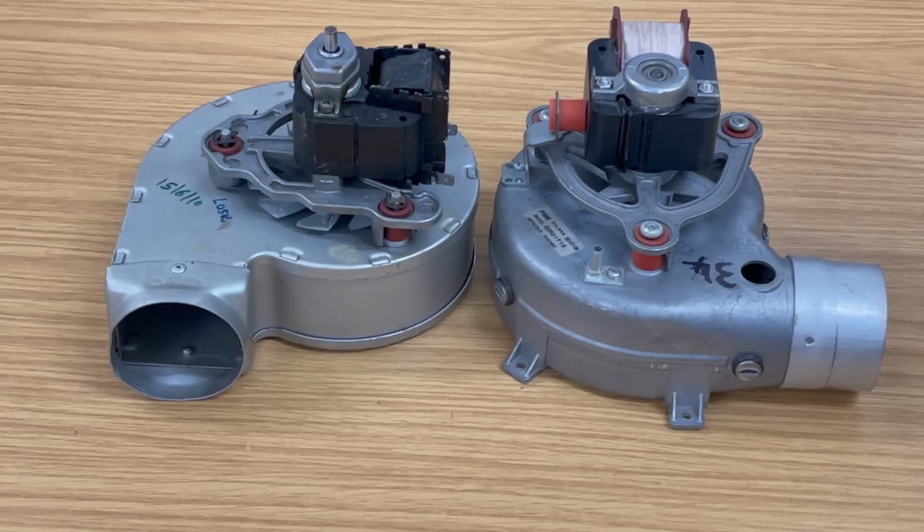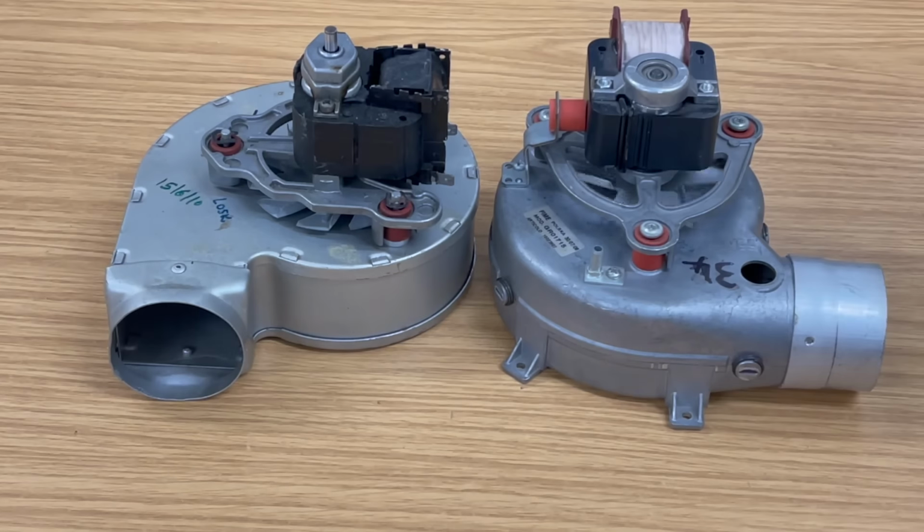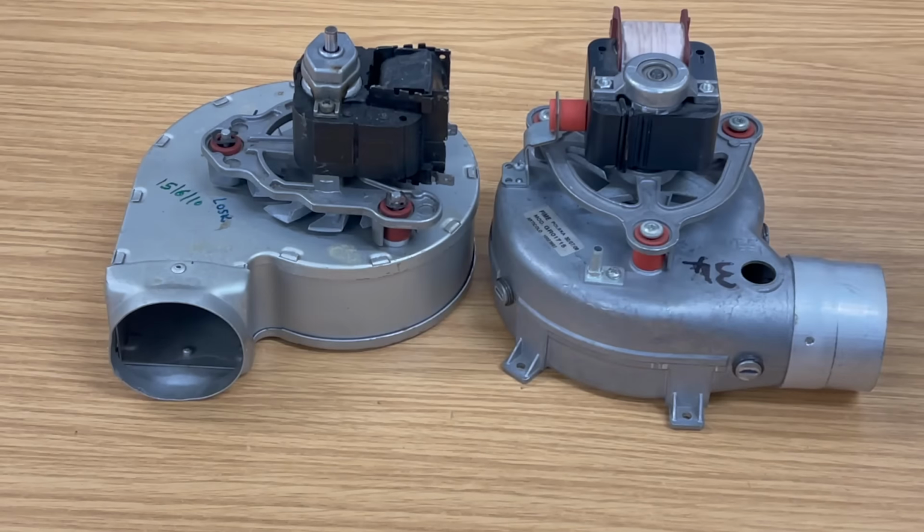Let me show you the easy way of finding out whether the fan needs repairing or replacing or what's going on, by that spinning test. So if we go to this one here and just give it a push, we can see that it's obviously lovely, moves gently and stops easily. So let's try this one straight away. See, it's stuck.